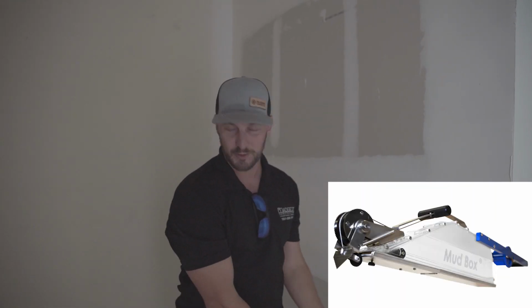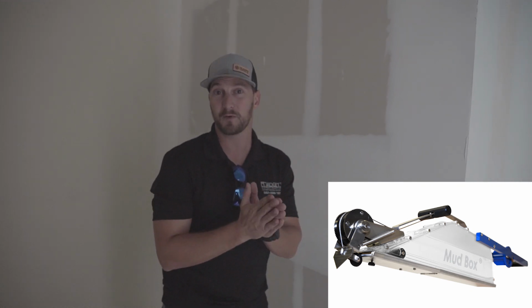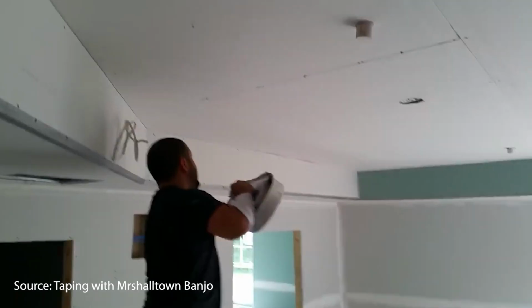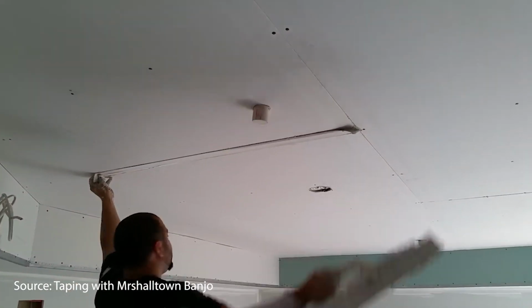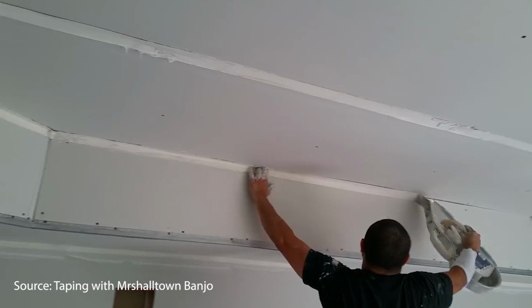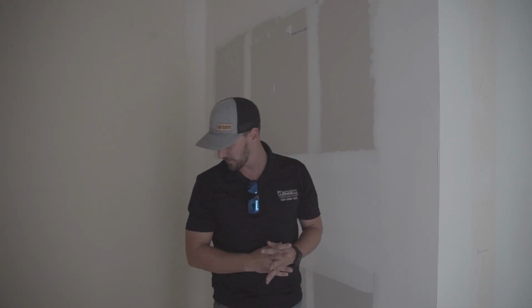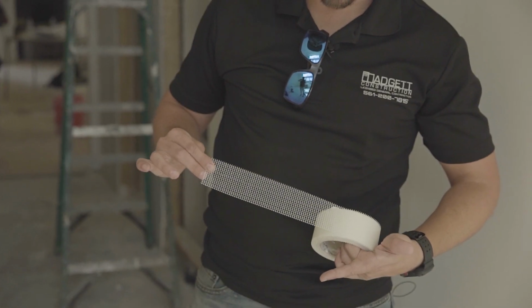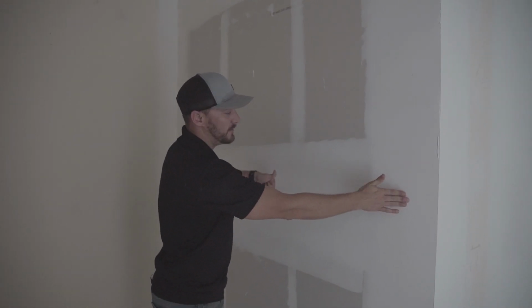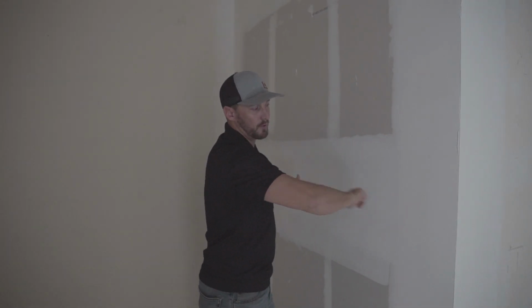So there's gonna be guys on this channel that are like, oh, I got a drywall company, and there's a tool that puts mud on your paper tape while you're putting it on. It's called a banjo or a box, and you can walk and put the paper tape on. But I've been doing drywall, I'm a general contractor. I'm good at drywall, I don't enjoy it. It takes me a lot of time. So I use fiber tape. I prefer fiber tape. The fiber tape is going to eliminate that whole step of having to put mud on, embed your paper tape, and then pull it all off.